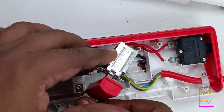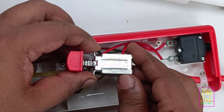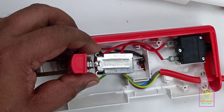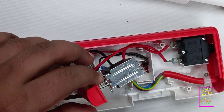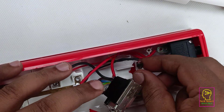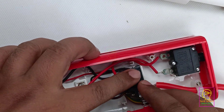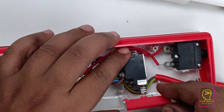The switch they are using is a solid one — you can see this type of switch in old televisions and musical systems. They are very long-lasting and will function for around 10 to 12 years without any fault. Something is written on it: 8 ampere slash 128 ampere and 250 volt. I don't know about the 128 ampere — 8 ampere is most probably for 250V AC, and 128 ampere is mostly for DC supply. I thought they were using LEDs but I can see they are using a neon lamp.